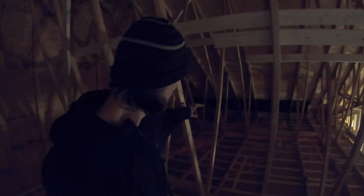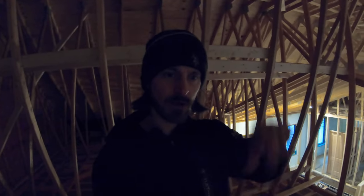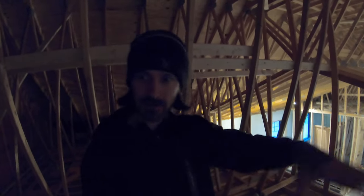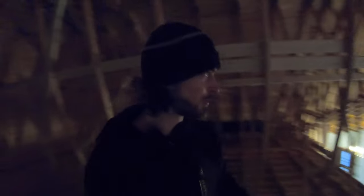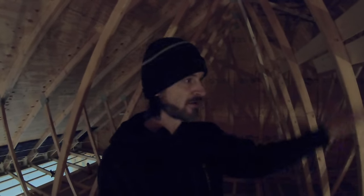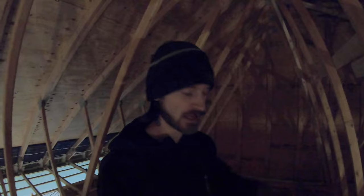If they could just come up here real quick and get a nice big foot or so buildup along the eaves and stuff, that will then tie the drywall to the bird blocks, to the air channels, and that will seal everything along all of the perimeters and all of the edges a little bit better. But I probably would go ahead and just spray an open cell, so that way we actually don't have to worry about a vapor barrier. Air can still leak up in through here, so we're not creating condensation if it does need to dry out.